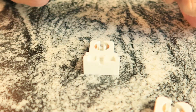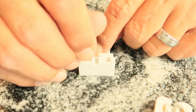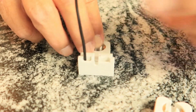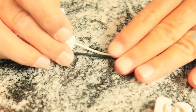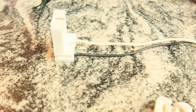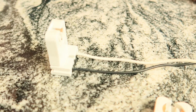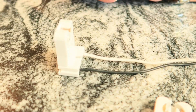Then all you're going to do is, on one side for a single-ended LED light bulb, push the black wire into that terminal — and that's not coming out. Then on the other side push in the white, the neutral wire. Now you've just created your own tombstone ready to go into a single-ended LED light bulb. If you find single-ended bulbs online that don't come with these, you can make these yourself. I'll put links in the description for the LED bulbs and the tombstones, and you'll be ready to go.